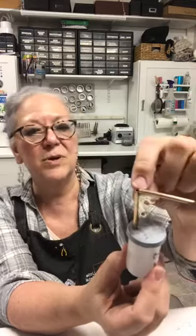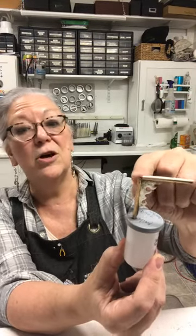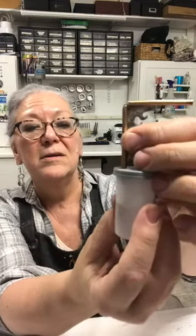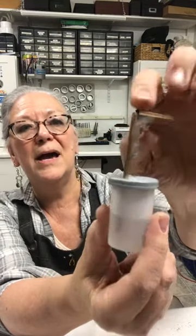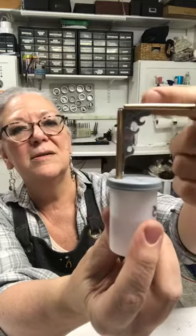And then I've just got a 3 millimeter tube on the inside that's about 1/2 inch long that goes down on the inside of that, and then just soldered at a right angle. Again, so that the top of the narrow tube is about halfway up the mouth of the wide tube. So it creates negative pressure and blows straight across.